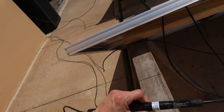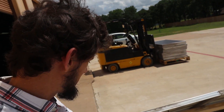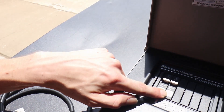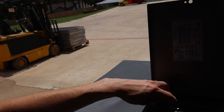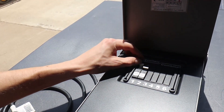Running through this branch connector we've got the 15 amp fuse rated for 1,000 volts. With this third string we didn't run a branch connector, but we did run a fuse, because back at the combiner box — where you would typically have your 15 amp breaker — I only had 20 amp breakers available, which is why I ran my 15 amp fuses. If I replaced these with 15 amp breakers it would be fine. I could add a third breaker — three 15 amp breakers or even a 10 amp breaker — and have each string come in individually. We can do it either way: fuses out in the field or breakers in the combiner box. I chose breakers because that means I can flip them on and off and turn on certain strings to test things out.